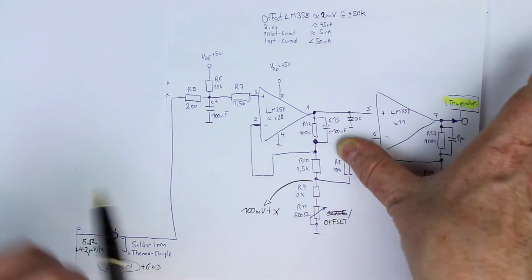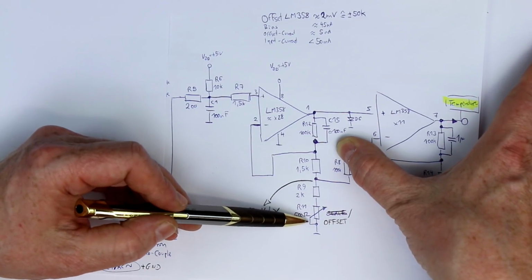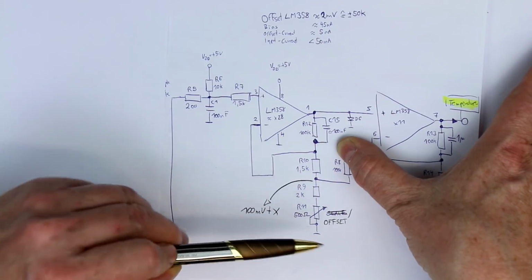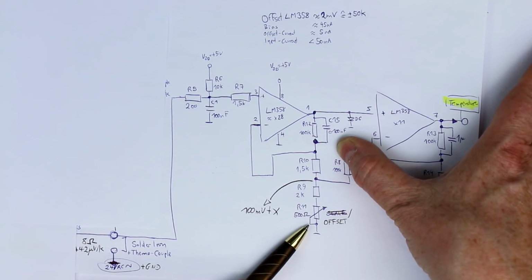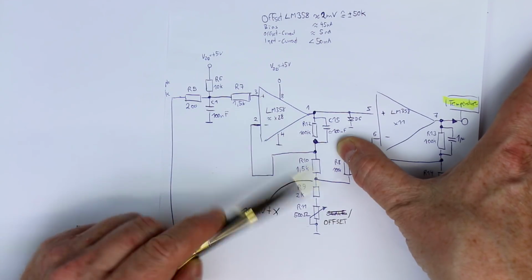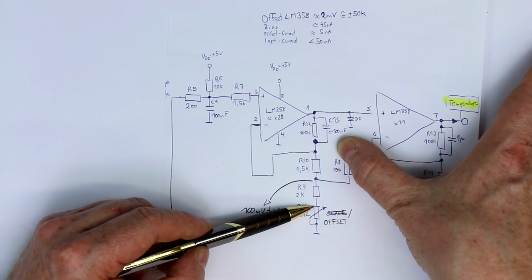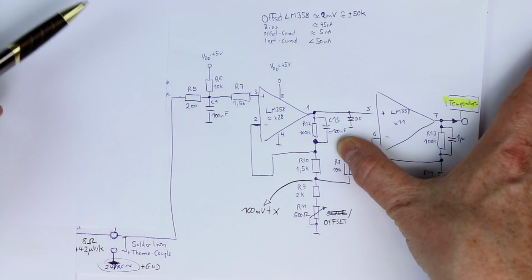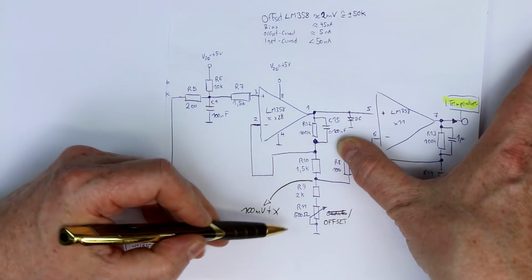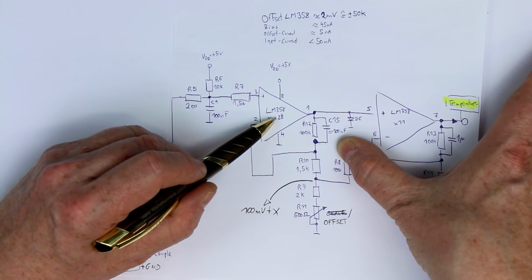They tried to get away just with 2 amplifiers and with 1 trim pot, but that's not how you should do it. So that's also the reason where the temperature error came from, because every op-amp you buy has a different offset. You can trim out the offset, but then you get a wrong scale factor. And with the setting that I measured, 125 ohms, you get a gain of around times 28.